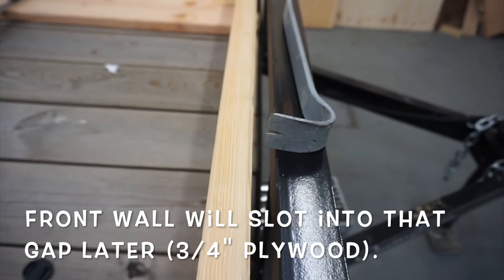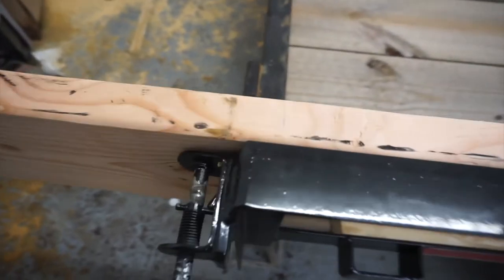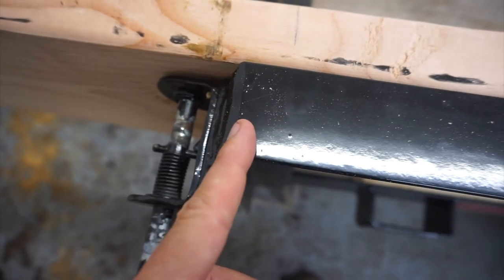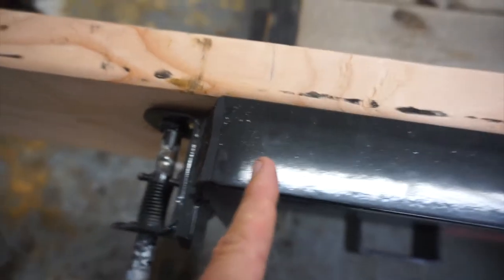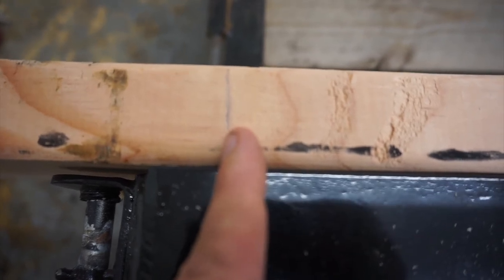So we've created a bit of a space here — we're going to do this for the front ply, and then this board touches up against that point. We were talking about cutting these down, so this piece has to go, but we have to do it in such a manner that the plywood will sit on this rail back a little bit. We have to mimic that all the way across. The back of this equals roughly where the outside of the ply has to sit, then we go back three-quarters of an inch — the thickness of the plywood — and that takes you to right here where I've already marked this board to be cut. We're going to do the same thing for the other side.